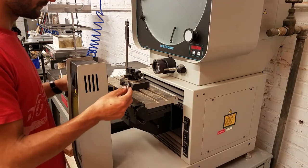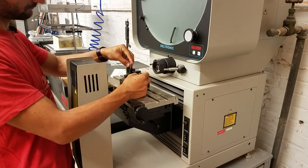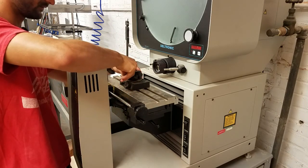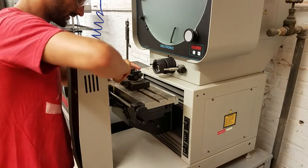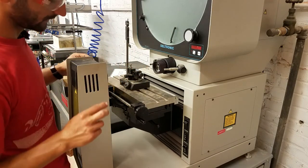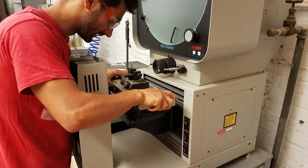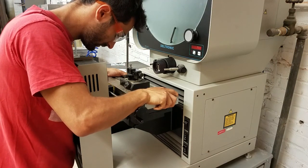For loading up our piece, we're first going to put it in profile mode. Let's say we wanted to measure these threads — I'm going to clamp it right in this little clamp in a vertical position. You can also put it in a horizontal position. A lot of the pieces on here can turn if you loosen the relevant knobs. We're just going to put it right back to zero. You can actually turn this whole table too — just loosen a handle underneath and it lets you turn the whole base. I'll set it right back to zero so we don't get confused.